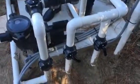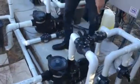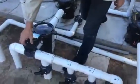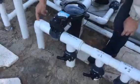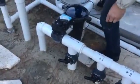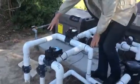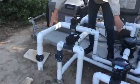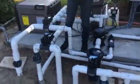And of course, if you turn on the main pump because this was in spa mode — in other words, when this valve turns here, this valve is going to turn all the way the opposite way, close all of these off, suck from the spa only, turn this off, close all of this side off, and return to the spa. So we're sucking and returning to the spa. Therefore, you're only heating that body of water right there on the spa.